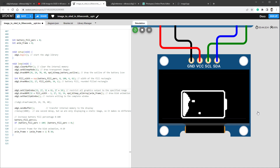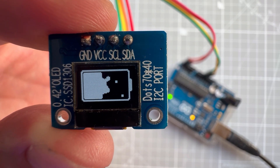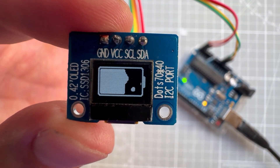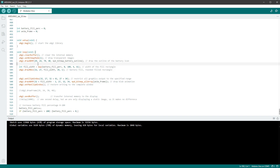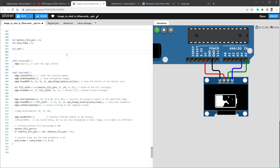I copy the code and paste it into the Arduino IDE, upload it to the Arduino board, and in a few seconds the animation is running on the OLED display. I really like how it turned out. However, I then realized something important: the PCB text says 70 by 40 pixels, but the actual display resolution is 72 by 40 pixels. Searching the U8G2 documentation for '72 by 40' reveals a proper display initialization — using the SSD1306 72x40 F hardware I2C constructor — which means I no longer need to offset the content manually.